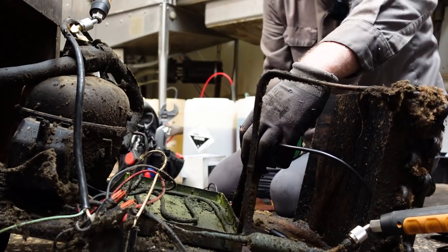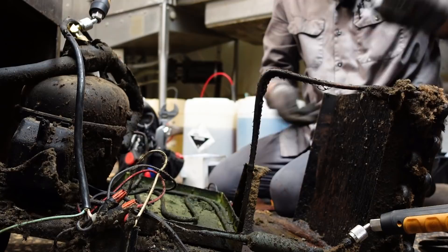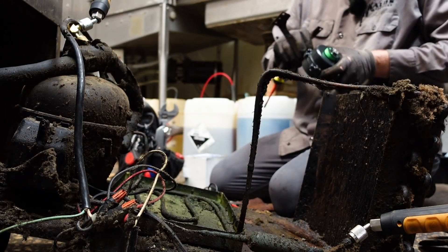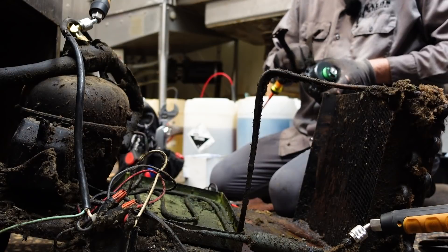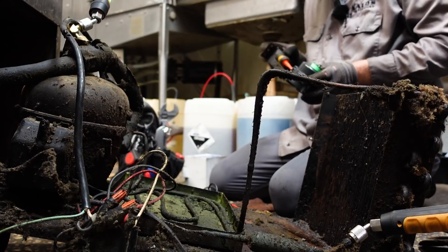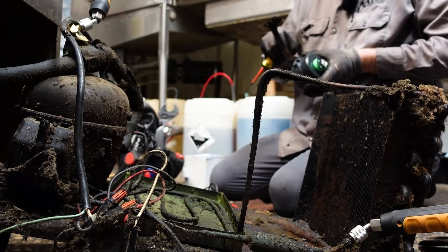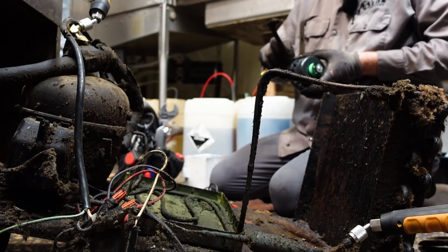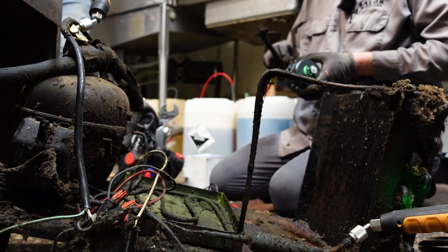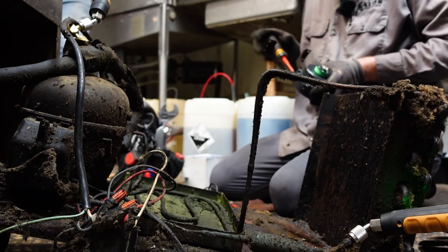Blade closer to the condenser. There's nothing guiding the air through this condenser except for the condensing unit being in the cavity it's in, unless that shroud was just lost to time. The old motor here says clockwise. This says clockwise O-S-E. So is that the right direction? I guess we find out, right? Opposite shaft end? I mean...